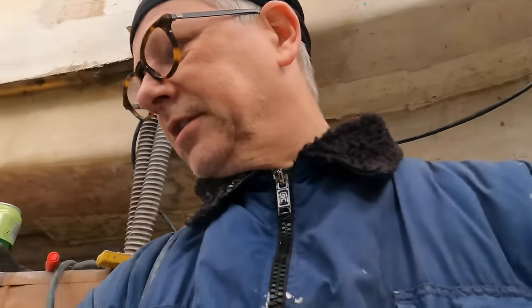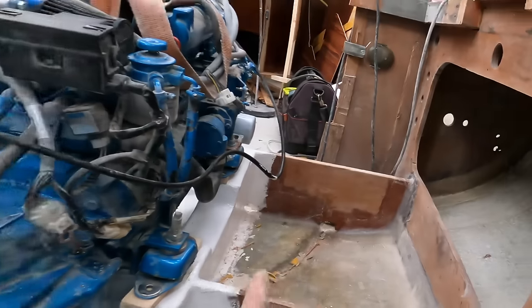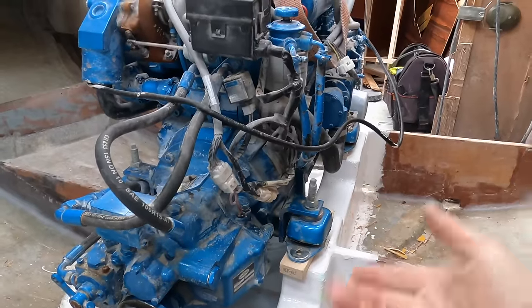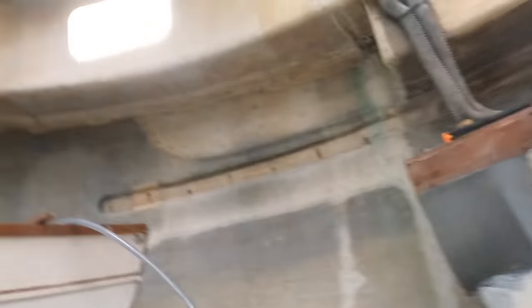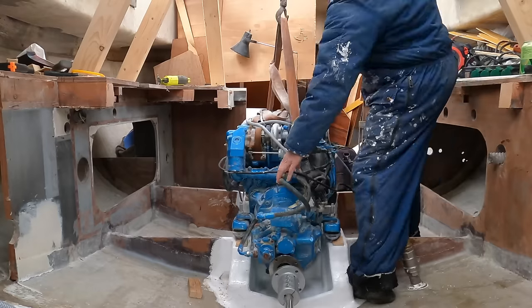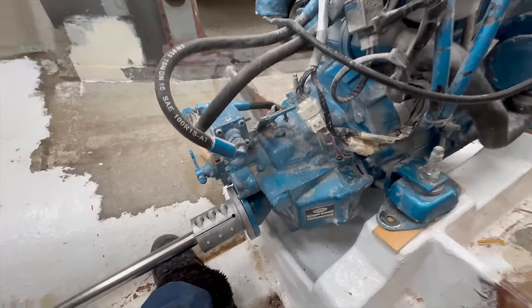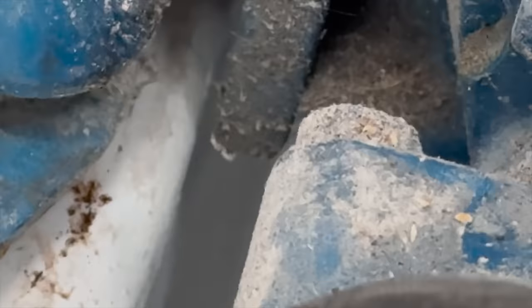Status number one: I forgot that the engine is not meeting the shaft. The shaft is far too much backwards and the engine is actually going forward. That will raise the engine a bit. With minus two centimeters we can see it's way too high — we need some smaller pieces, and the engine a bit further forward. So it's about correct now. It's slightly higher than the engine — or is it? Now we have plenty of space on this side, not so much space here anymore, but maybe enough.